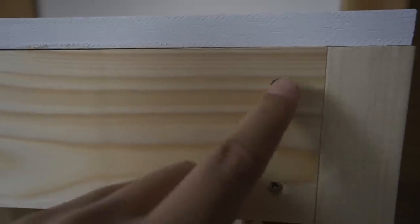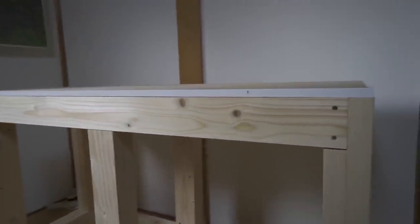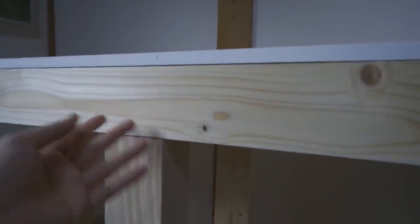And also, I did countersink the screws a little bit because I want to cover these up with wood so that we can have a nice, seamless, perfect look to the stand, a nice finish. I tried to minimize the amount of screws I put on the outside of the stand, so you can see for these beams right here, all the screws are sunk in on the inside, because once we have the doors on here and the side panels, you won't be able to see any of the screws. So you can see most of the screws, even for the side panels, are on the inside and even in here. Kind of a challenging job. It would be much easier to put screws through the front, but then it wouldn't look as good. So I just wanted to go all in with the stand.